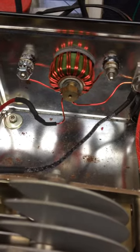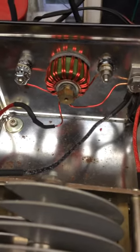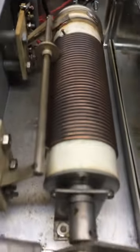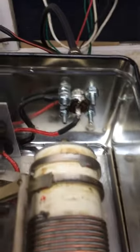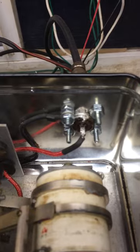We have 14 turns of double-wound magnet wire. One side goes to ground, the other side bypasses the capacitor to ground, and then it's straight through the roller inductor and a connector onto the rig. That's how the balanced line connects to the rig.